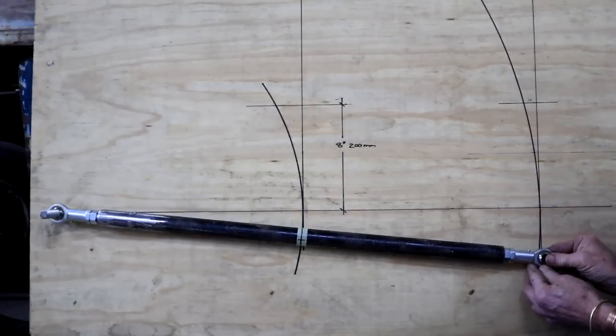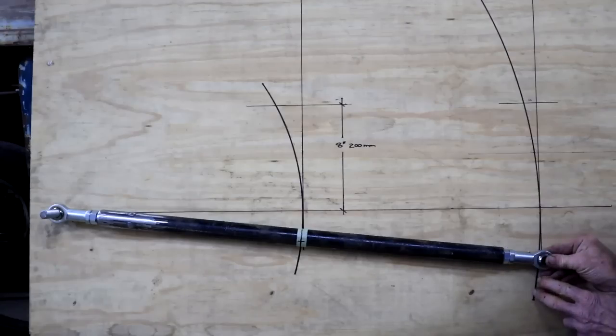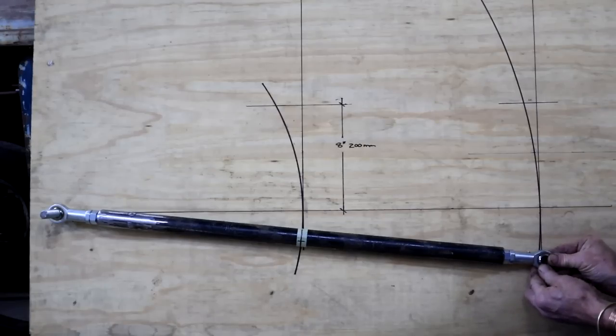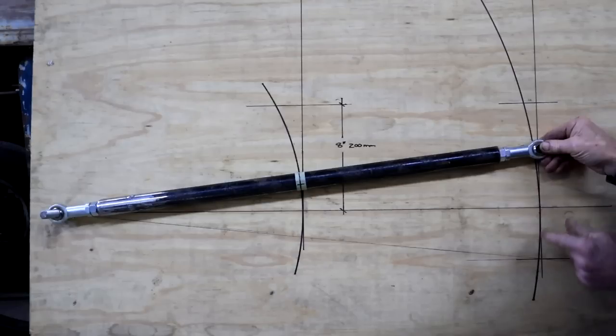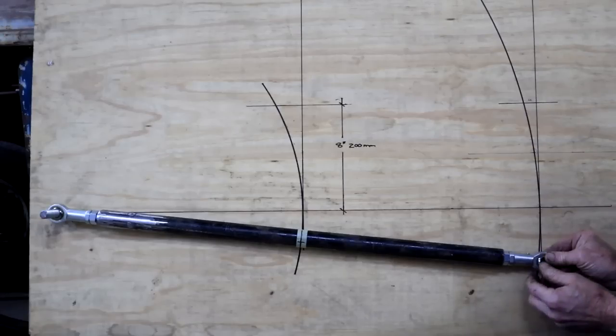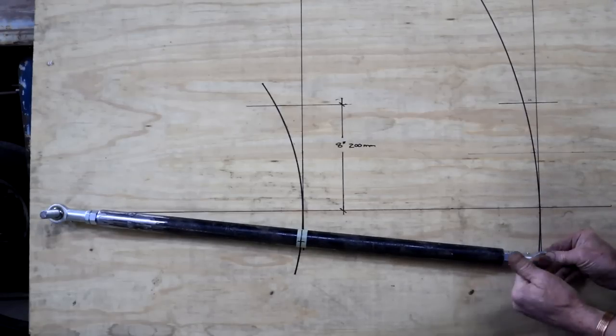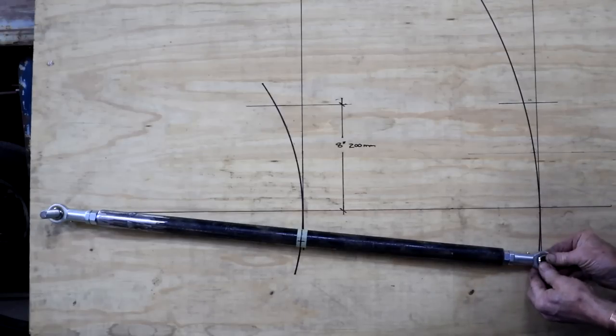So the way my bracket currently is, that we looked at earlier, when I cut it down, I've got my link bar sitting at about 5 degrees at my design ride height, at which point I will have 8 inches of ground clearance. And then if I slam the truck, it will move up to that position. There's the 8-inch change. So this is the position where it's fully slammed. Now I'm still not quite sure about this 5-degree downward angle. I know the guys talk about anti-squat properties, which also induces roll steer, and then we go down a whole avenue of stuff I know very little about.